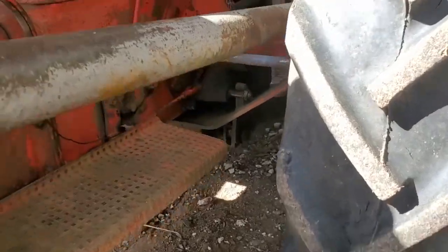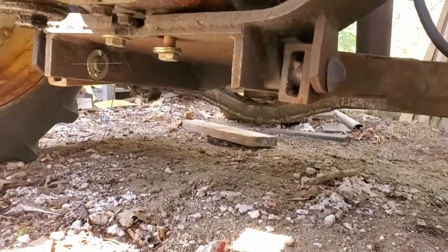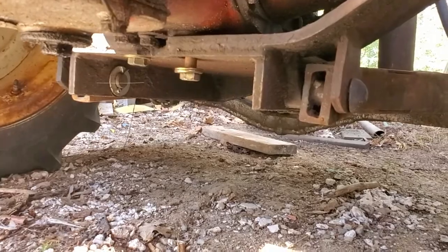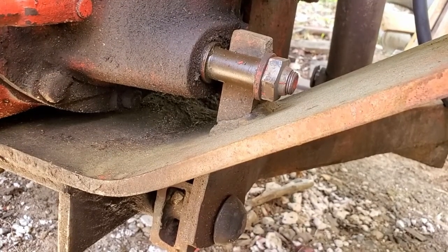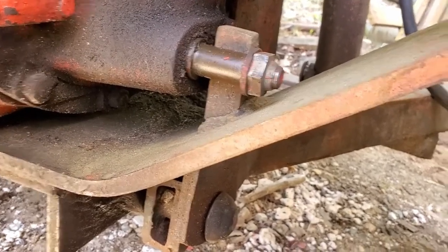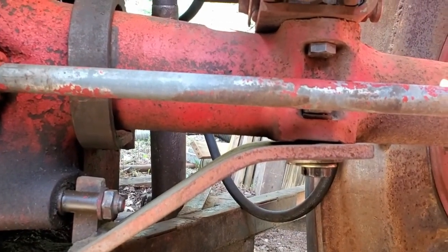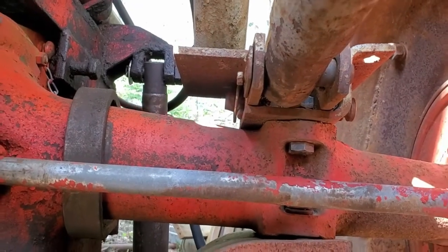And on the left side of the tractor, I've got one bolt that's a little too long, so it's just sitting in there for now. That vertical block is welded to the backhoe frame, and that fetches up against there to stabilize things. Again, on this side we have backhoe frame bolted to the bottom of the differential, and loader frame is bolted to the top.